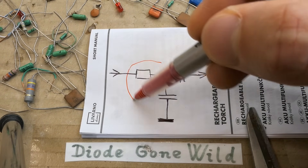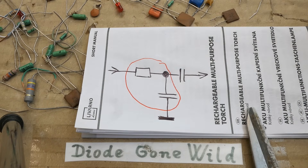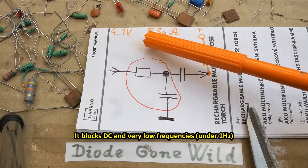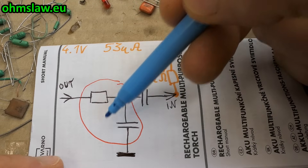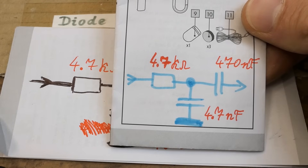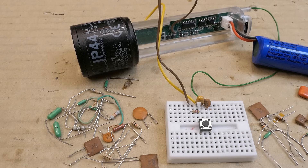We need a bit more than just a capacitor. To get rid of the high-frequency pulsing we need a low-pass filter — this stops 20 kHz but the flashing at just a couple of hertz still gets through. Then a DC-decoupling capacitor goes into the input. This thing with the internal pull-up resistor is basically a high-pass filter; measuring at 4.1V it passes 53 µA, which means the internal pull-up resistor is about 77 kilohms. So this is a high-pass filter, the other is a low-pass filter, and the whole combined thing is essentially a band-pass filter. After a lot of trial and error this works best. Now: high, medium, low, one press — it blinks twice, automatically steps through the flashing modes and turns off. The flashing and the SOS get skipped.